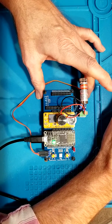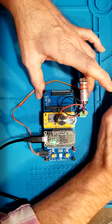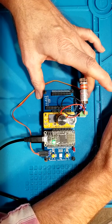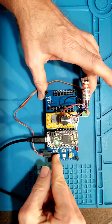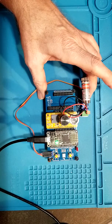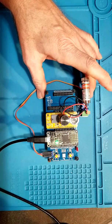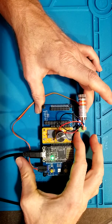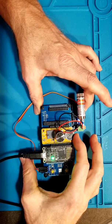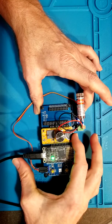And you'll notice that it's split the serial window horizontally. And now you have a plot window to go with the serial window and your code window. So to actually start this part of the demo, you press SW0 again. And you'll notice that there's some print output showing up in the left-hand screen. It looks like a single-valued tuple. And in the right, you see that it looks like it's trying to plot something. So it's telling you to rotate the potentiometer. And as you rotate the potentiometer, you can see that it changes the plot value.